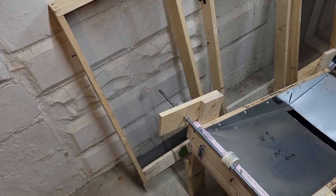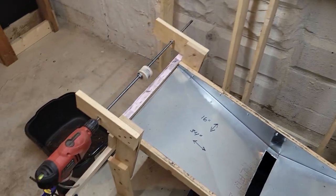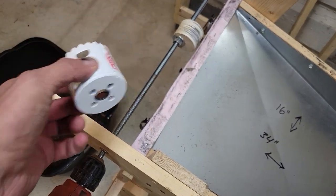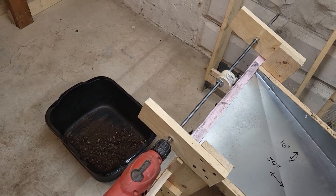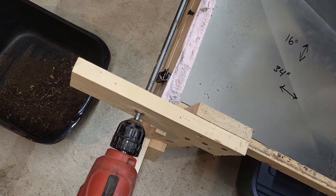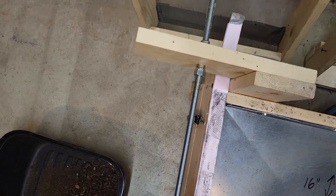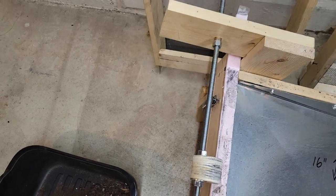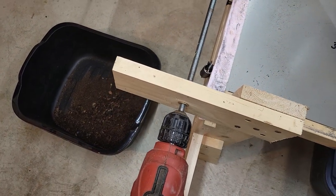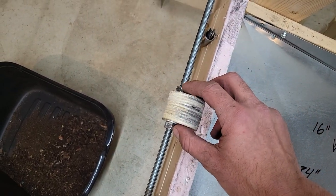This is the very fine bug screen — I think that's about 1/16 inch — it's just your typical bug screen, for the very fine castings. What operates this mechanism is I used a hole saw to cut a disc out of a 2x4, then drilled another hole off-center so it's got a cam action. That's 3/8 threaded rod, also available at any hardware store, with nuts and washers to keep it where I want it. There's a brass bushing in between there just to protect the wood and make it last longer.